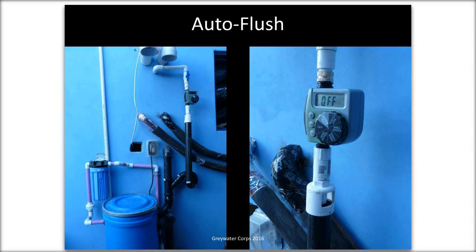They can be a little smelly. So anytime we've got water in a tank that's connected to a sewage system, it's not clean water. You want to have a P trap, which seals that off from the atmosphere around you. Anything going into a gray water tank should have a P trap on it. That goes for both the fittings, the bathtubs and showers and all that stuff, and also the air gap. Also the auto flush.